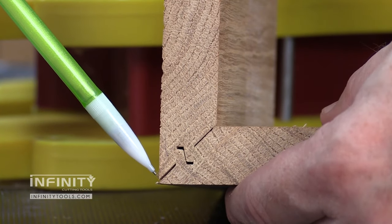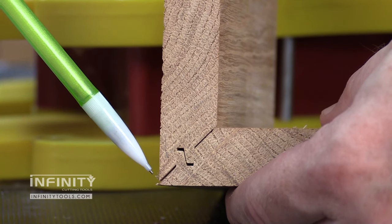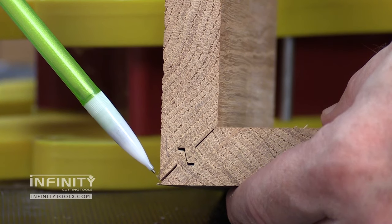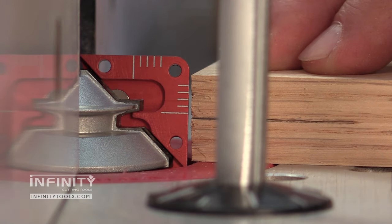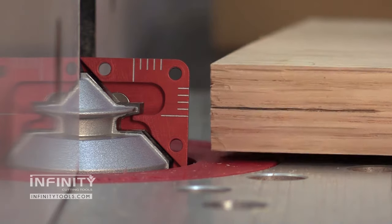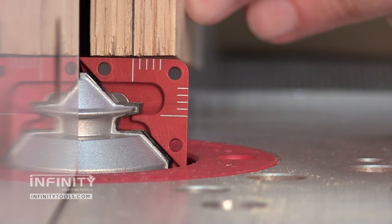I've assembled my test pieces and you can see the joint doesn't quite come together perfectly. So I put my lock miter master jig back on the bit and check my fence position and bit height one more time — just double check to make sure everything's accurate and make one more test cut. I put the jig back on my router bit, checked my setting, and found my bit height was actually a little bit off, so I made that adjustment. Then I went back and checked the fence setting using the center line of my workpiece.